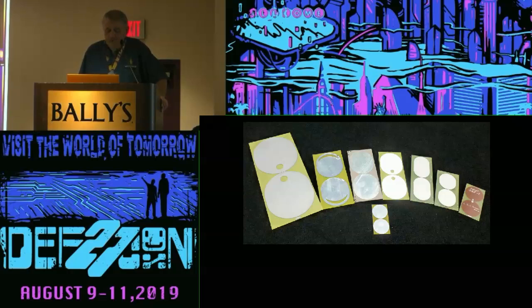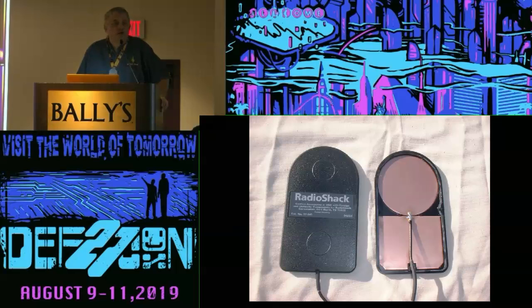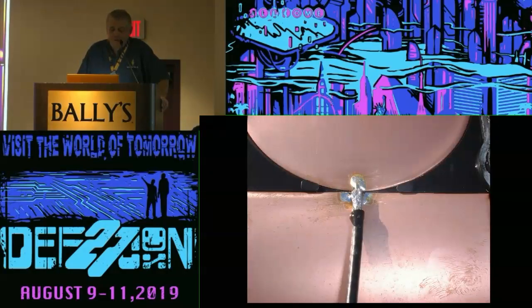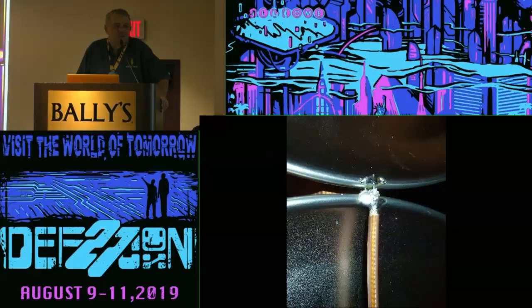We have a variety of them here. The one on the upper right is currently in orbit on a Canadian satellite, and some others are going on satellites shortly. The one on the lower right goes from 700 MHz to 26 GHz — pretty much a circular pattern at the low frequency, becoming more of an ellipse going up. Radio Shack used to sell a version as a universal cell phone antenna. You can also go to the dollar store, get some 18-inch pizza pans — not aluminum, they're too hard to solder — mount them as close together as you can, and you have a monitoring antenna from about 150 MHz up to about 2 GHz, depending on how good your soldering job is. All construction articles are available on my website.